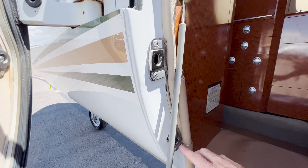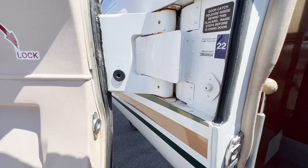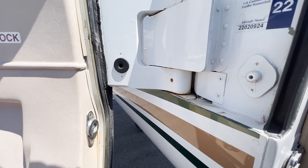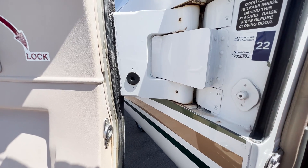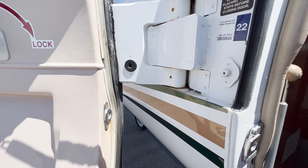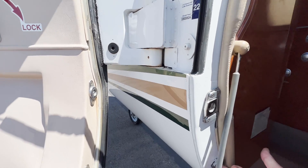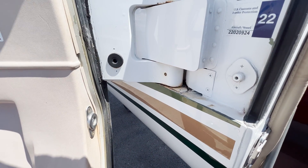Tigre has it all started. Here's the micro switch down here — I'm going to press that and we're going to see if any water comes out. We're pressing it and it's dry. We live in a pretty dry environment, so it's really easy to do that and test it. The air comes out there, and if we had any issues, water would just spray out like it did the other day with our other CJ. I got just a little bit there — it just sprays right out of that port. So again: start your engine, come down here, press this button, and the air will come right out of that service port.